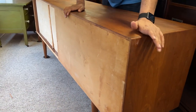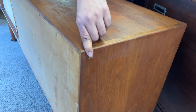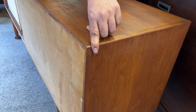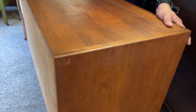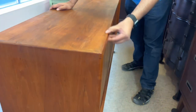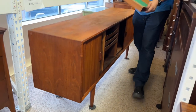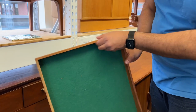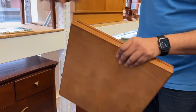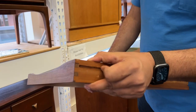What the Danish high-end furniture makers did is use solid wood edge banding to protect the corners. You can run this against an edge and you'll dent it but won't have major damage. Run a big box store dresser against an edge and you'll see a big chip. The edge banding is solid, and I think the drawers are solid as well. The back panel is solid, and the sides appear solid too — they're small pieces of wood so it doesn't cost much more to make them solid.